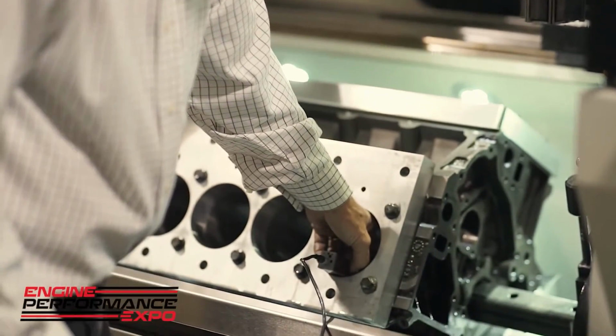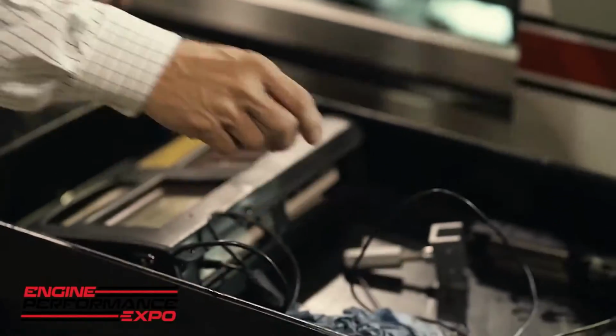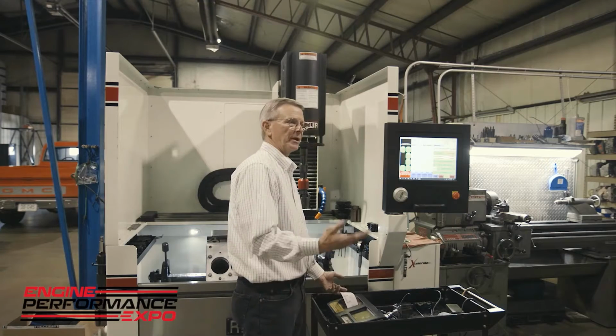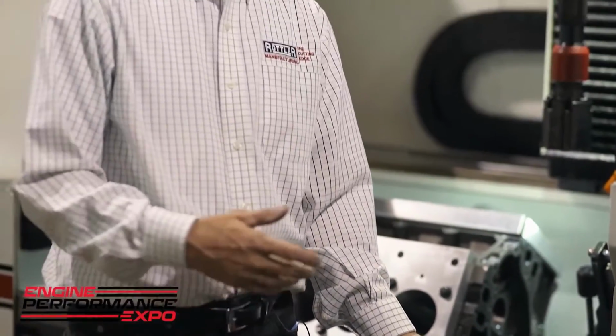This particular profilometer is a Mitutoyo 301, so it gives me the ability to print out what the surface finish looks like and the RPK, RVK, and RK factors. And that's really what I'm doing right now. It's taking the trace, and I'm just printing out a representation of what the surface finish really looks like.